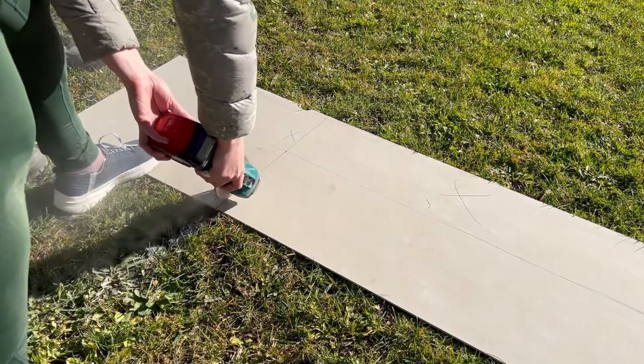I started painting on the waterproofer and then realized I wasn't going to have anywhere near enough, so I painted on what I had and then went and bought more so that I had enough to do two more full coats. Here I am the next day with the waterproofer, coming in to do one complete coat all at the same time. I started on the bath side, moved around underneath the window, kept going throughout the rest of the bath side, painted all over the shower, and then finished off with waterproofer on all of the floor.